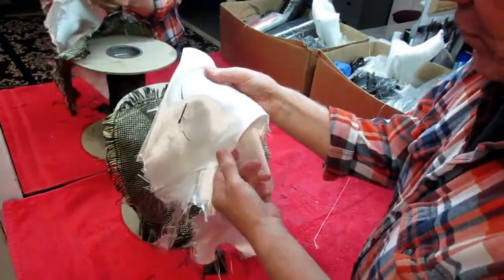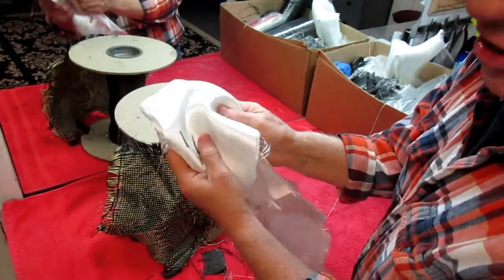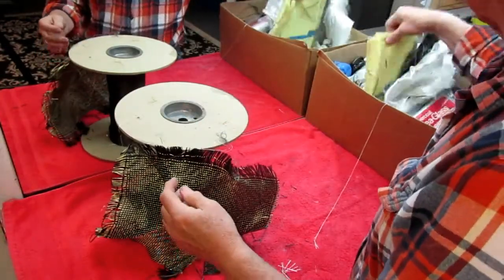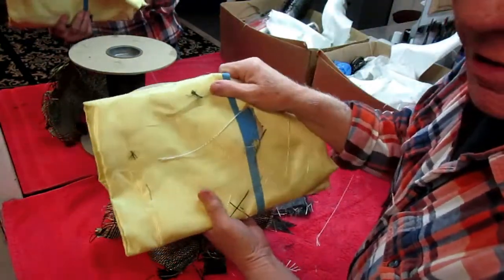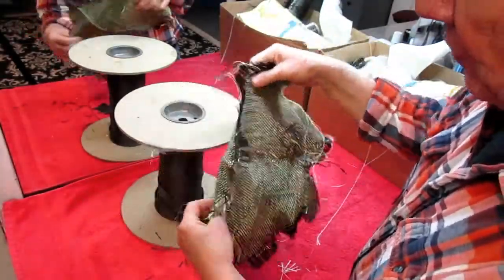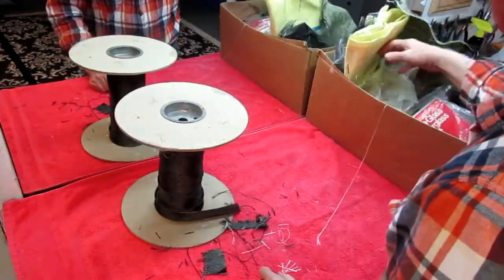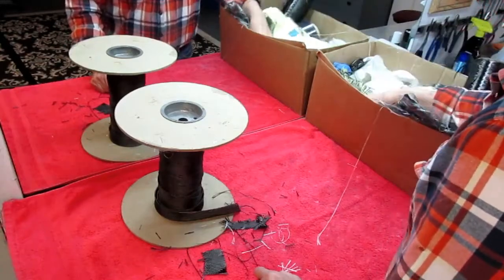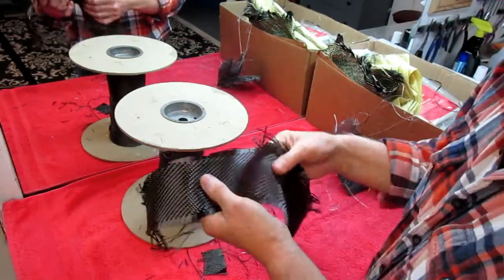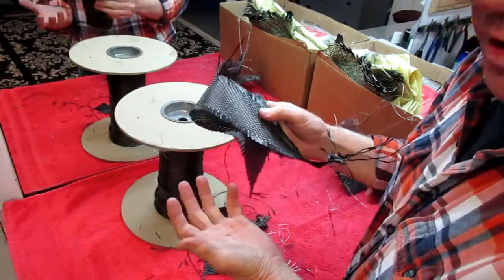Everybody knows, I guess you can show what this is. This is e-glass. It's what they make boats out of, fiberglass, or old-fashioned motorcycle helmets. E-glass has a strength. Let's call this 1. Kevlar, let's get a piece of Kevlar out. Straight Kevlar is 3 times stronger than e-glass. When you mat it in with this, it gives certain properties that are better than carbon all by itself. But real carbon fiber, and I just have to find a nice piece to show for a demo. Well, we'll use this piece. This is 3 times stronger than Kevlar, so it's 9 times stronger than e-glass, relatively speaking.